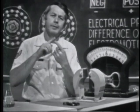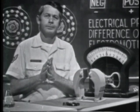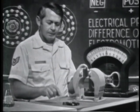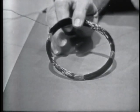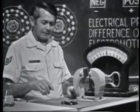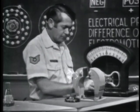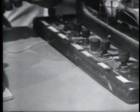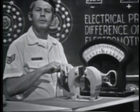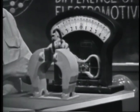Let's demonstrate this method. Remember, we need a magnetic field, a conductor, and motion between the two. Here's a magnet — it'll give us the magnetic field. This coil of insulated wire is the conductor. To check for a voltage, I'll connect the conductor across the meter. Now, when I start moving the conductor, notice that the meter indicates a voltage.